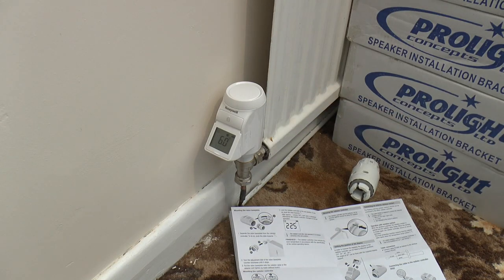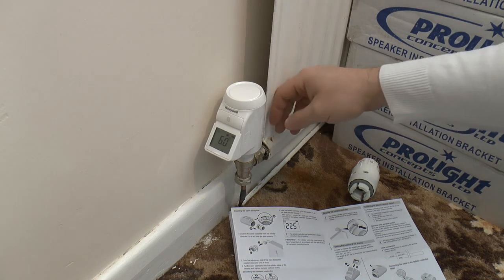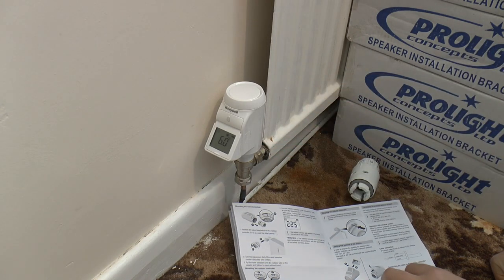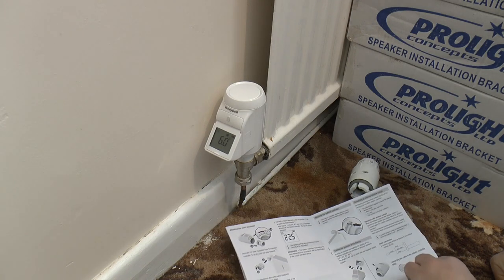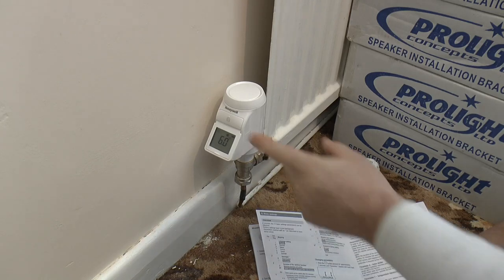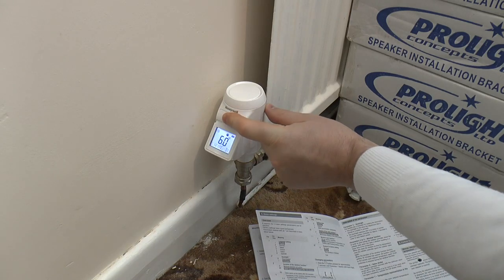In fact, the boiler's just kicked in, so I should be able to hear if this hasn't closed all the way up. Obviously, if you've got your boiler running and these things are off and yet the radiator is still getting warm, you know you need to change the setting in the menu on that. And to get into that setting, as well take a look anyway, we accidentally did it earlier on. You press and hold that,